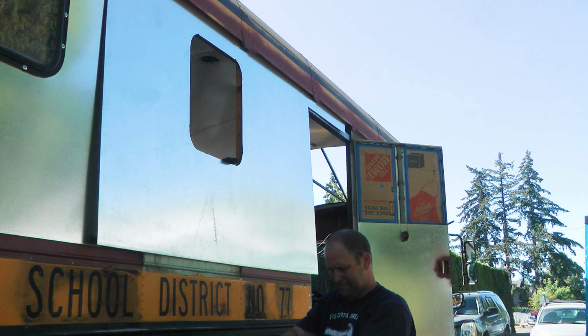Okay, so now let's move into the inside. So this is our current floor height, but our finished floor is going to be another 2.5 inches higher than this. But I want my rise from this step to the finished floor to be 8 inches, because that's going to match the rest of the steps. But I have to remember that on top of this 2-inch tubing is going to be 1.5 inches of wood and then some sort of finished floor as well. So I have to subtract the 2.5 inches from the 8-inch rise, but then add back in the 1.5 inches for the step material.